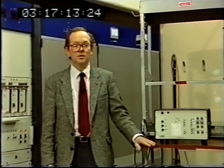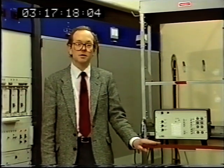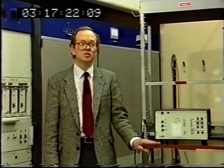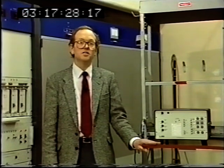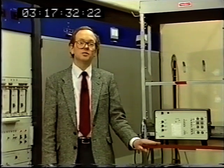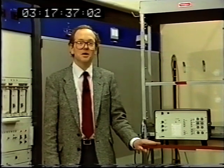As you might already know, the Black Mountain team's development work resulted in a modification that's been fitted to these generators. This expands its capabilities to provide a range of distorted ITS waveforms, again digitally generated and therefore stable. These can be used not only for checking the calibration of AMEs, but also for checking the operation of other equipment. Waveform correctors, for example.